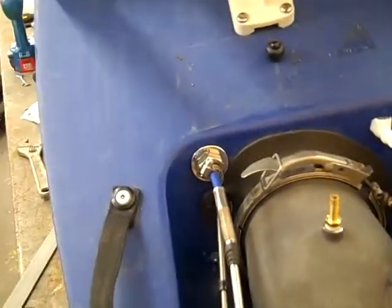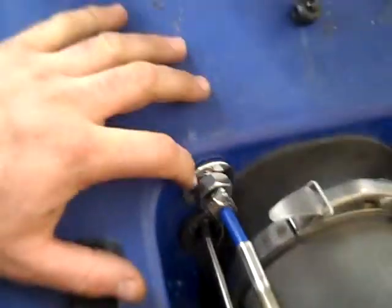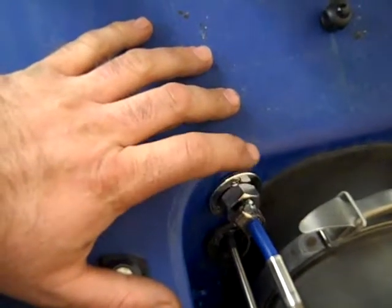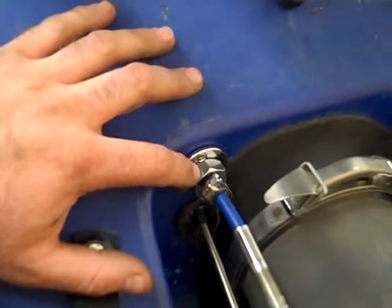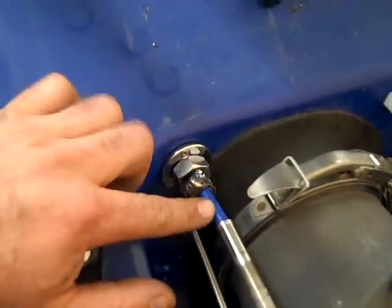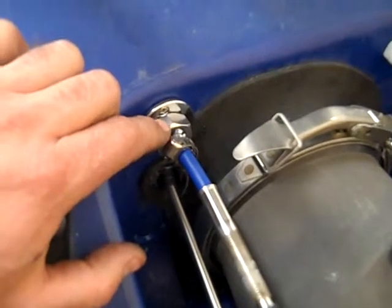I don't see anything that's going to break here. I used a clamshell — it turns out this is 10 millimeter plastic sheath. I bought a coax clamshell at West Marine, which is a clamshell to pass your radio coax through the hull. It goes up to 10 millimeter, 3/8 inch. It's a nice waterproof pass-through and you can crank it down pretty nicely and build some friction, but it doesn't actually have enough to hold the cable because it uses a rubber O-ring in there.